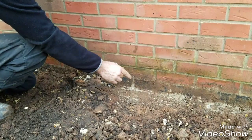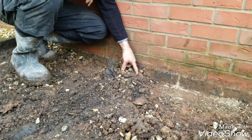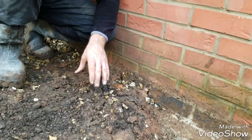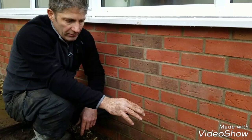What they've attempted to do is put a land drain pipe in, but it's a poor account of a land drain pipe. There's mud in the end of it — the water's going to come down, erode the soil, go down the pipe, and eventually it's going to silt up and block. The water won't get away, it'll back up, the brickwork will get damp, and because those courses are exposed to the air, it'll freeze, frost, and that expansion effect will start blowing the face off the brickwork.